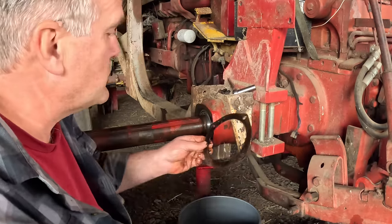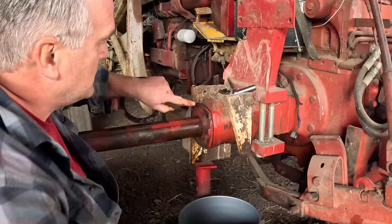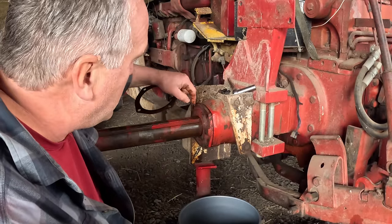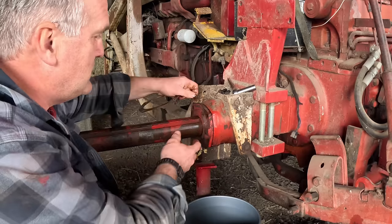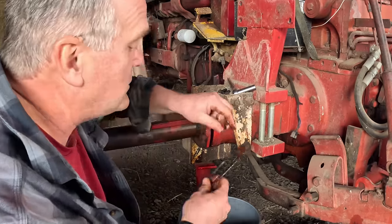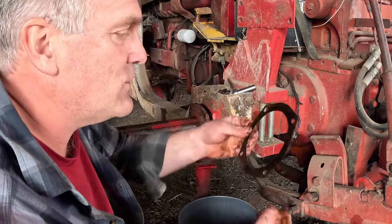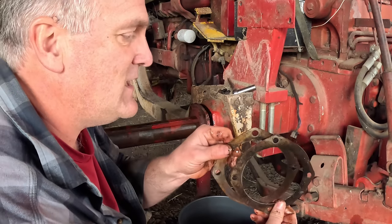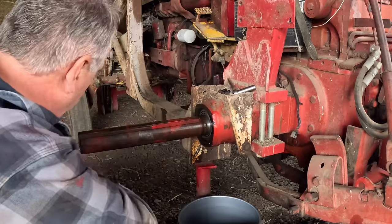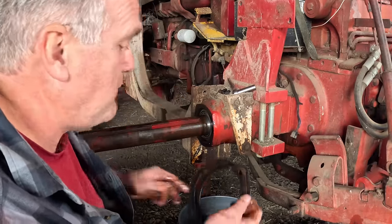And in the manual, there's a complicated process where you first put this cap on by itself, you torque two of the bolts down to a certain measurement, and then you turn the axle and you do it again, and then you start putting shims in and measuring with a feeler gauge how much thickness is left at a certain torque when you torque this down, and then you can figure out what shims you need to put in. It's clear to me that at least the preload needs to be measured according to the manual.